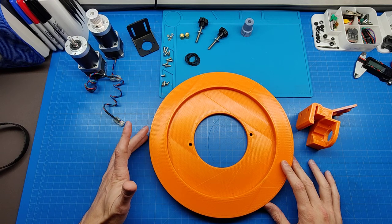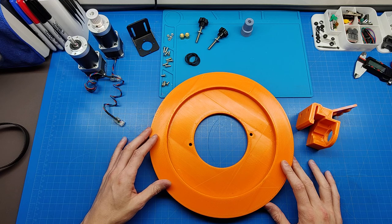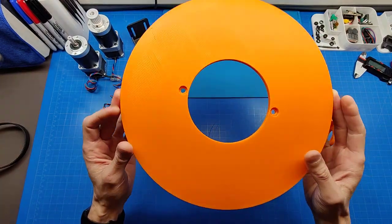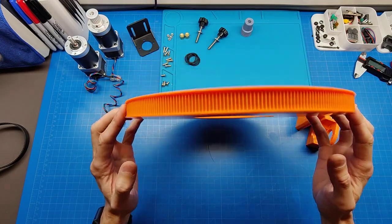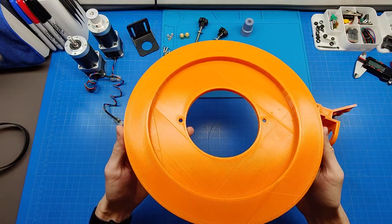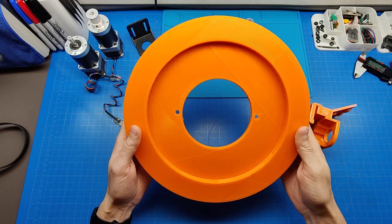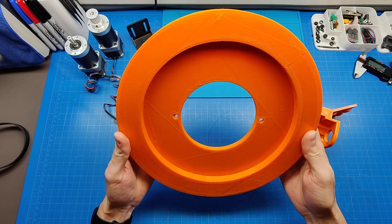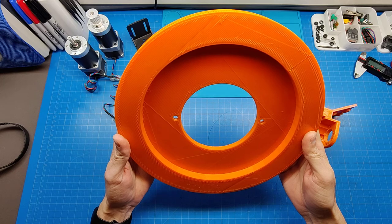Hi everyone, so today we're gonna check out probably the most minimalistic design of putting OnStep on Dobsonian. Minimalistic in terms of that you only need three 3D printed parts to make it spin. Specifically, a nice large timing wheel. This one basically you want to print as large as possible, which goes on your altitude bearing of your Dobsonian telescope.